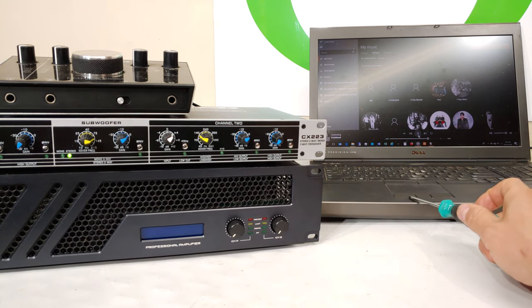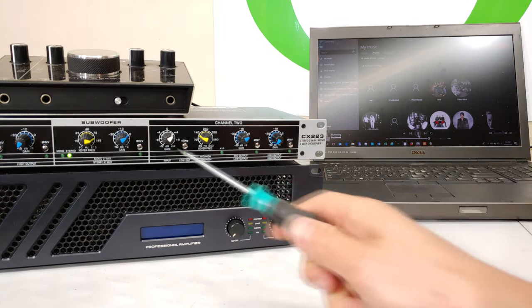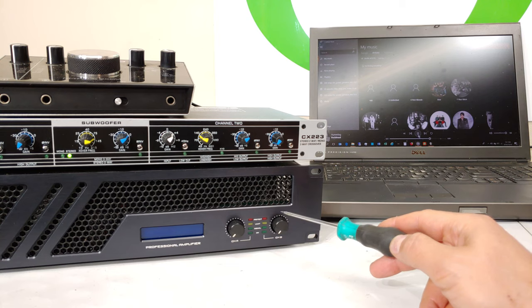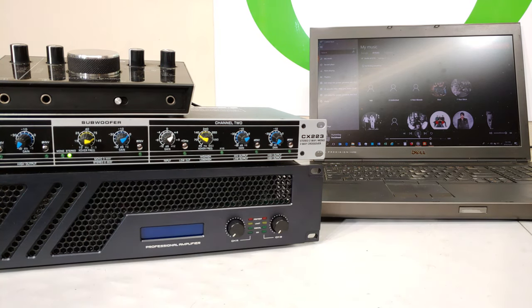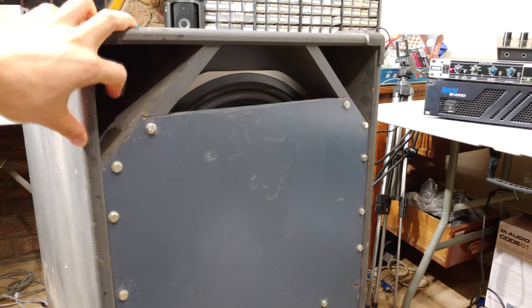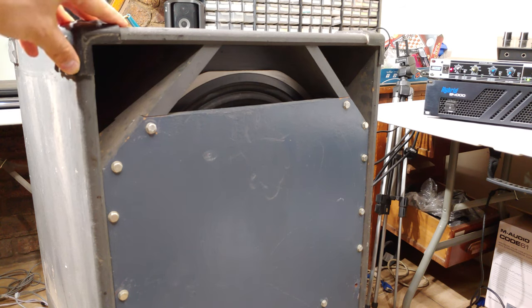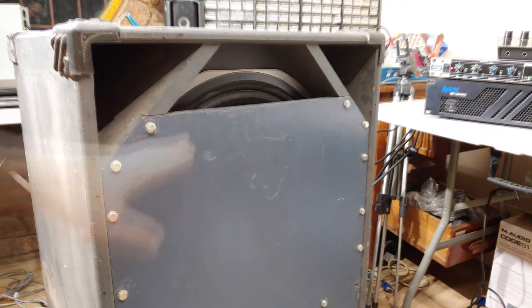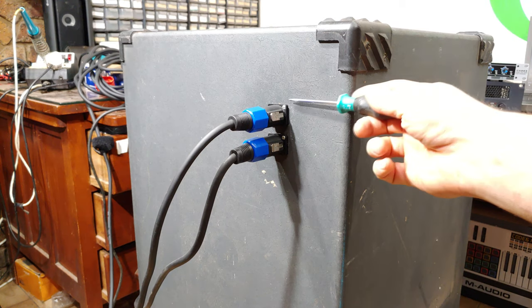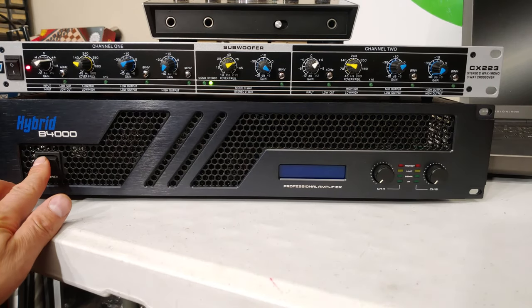For this demo: the laptop audio signal goes digitally via the audio interface into the crossover, set to subwoofer function, on parallel mode — meaning both channels will have the same signal but are independently controlled. The speakers here are dual compression chamber units originally designed by Fane Acoustics, 15-inch Colossus drivers rated at 800 watts RMS each. The Speakon outputs from the amp connect to channel A and channel B speakers. Now switching on the amp.